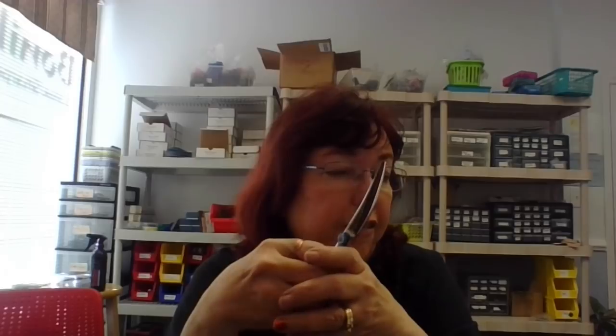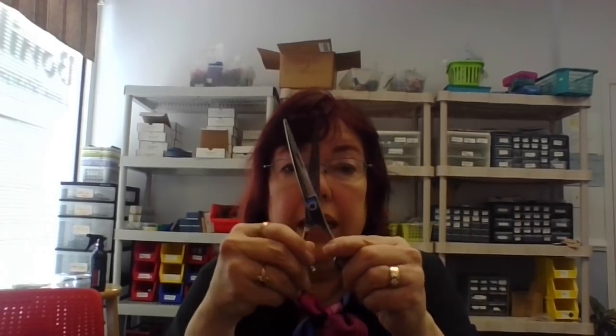Practice. There are some people that are much better at this than others. My suggestion is, if you're new to sharpening, or let's say maybe you're a groomer or a stylist, and you have that little bit of a pull in there, you can find some kind of a slotted something and go in here and work it a little bit on these curve shears, and just check it and bend it a little bit more, and check it and check it. But if you're new to sharpening, this is advanced work.